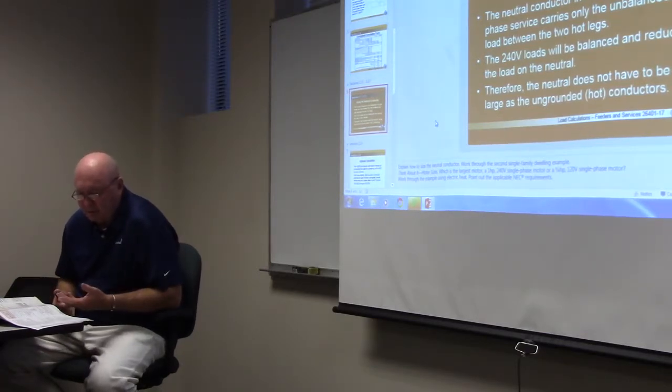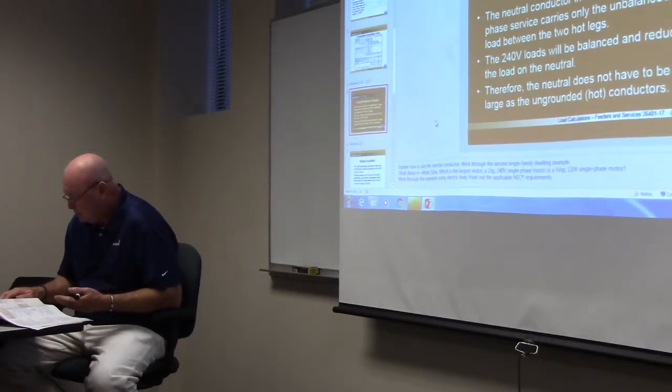If you read there on page 20, it says for a single phase residential service in conjunction with NEC 310.15(B)(7), now we turn to 310.15(B)(16). And for 100 amp copper, what size wire would we use? Anybody take a guess? Should be number three. Number three. Good, James. What size aluminum would we use? Number one. Good, Cameron.